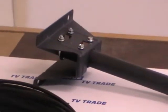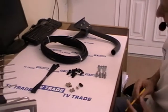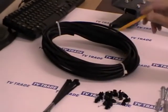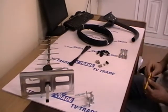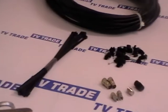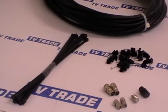The next step after that would be to connect a satellite cable or coaxial cable — which is a 20-meter cable here — from the TV aerial all the way down to the TV. We'd use the tie wraps and clips that come with the kit to firmly and securely clip the cable into position.